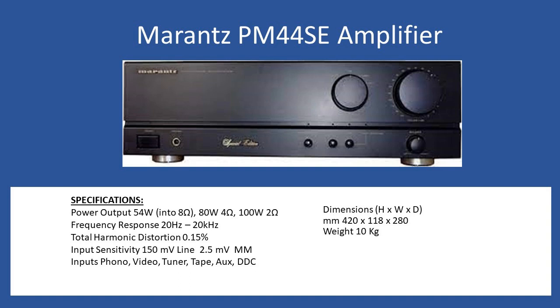As with other amplifiers of this type, these really just have age-related issues. This one came in with intermittent loss of sound — very common. The customer reported that moving the input selection switch backwards and forwards could temporarily recover the sound, but then it would be lost again, or they'd experience some level of distortion. With this series, that type of issue can be twofold: it can be associated with the input selection switch, which is very common for any amplifier of this age.